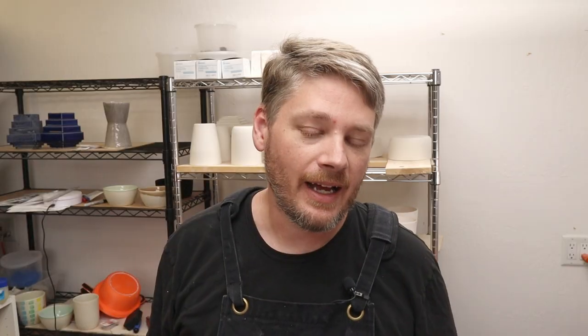So what went wrong? I think I had the plaster in the vacuum too long. I was waiting for the bubbles to foam up and they never quite did - or by the time they did, the plaster was already getting really thick. I thought maybe it had gone thixotropic and tried to mix it a little more, but no - it was actually starting to set.